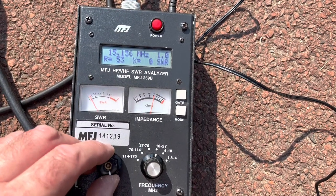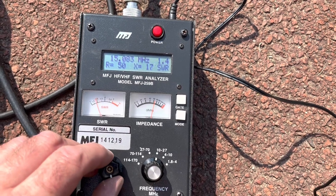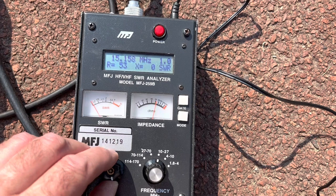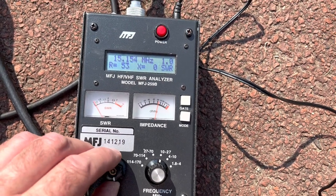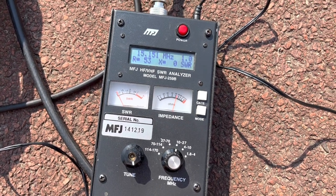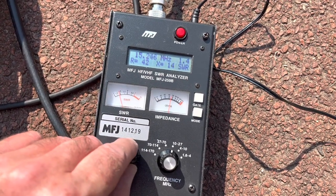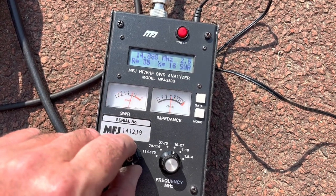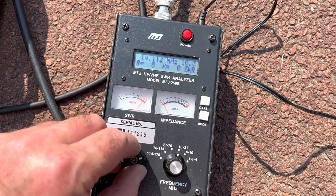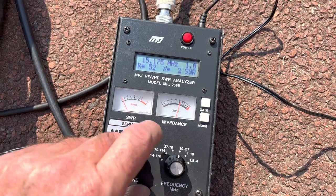There we are — just over 15 megahertz, so it's too short. The dip is at one and a half — 15.06 MHz — about 200 kilohertz wide. We either need bigger coils or more wire on the end. I might try more wire on the end to see how much I need, and if it becomes excessive I'll increase the size of the coils. You could do this with your SWR meter on your rig, but if it's this far out of band it's hard to tell where you are — at 20 meters we're just high all the way through.